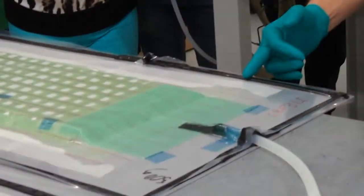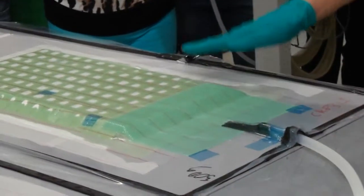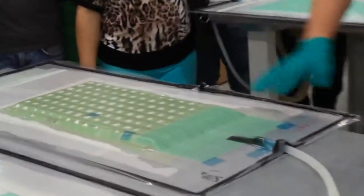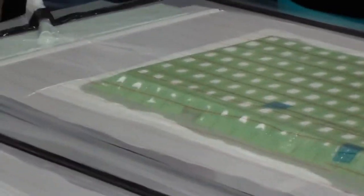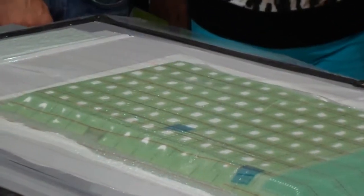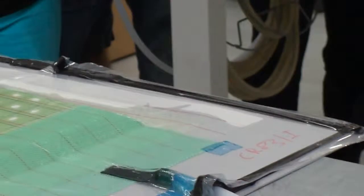So therefore, you need to make folds over here and over there, so that the foil can really connect to the shape. If you have a vacuum bag which has such a high tension, like on the glass fibers, if you have a strong one, you can't drape them very well. If you have a weak one like the twill, you can drape them very well, but the strength is not as high compared to the other one. So this is due to removing the paper and pushing the foil on that.